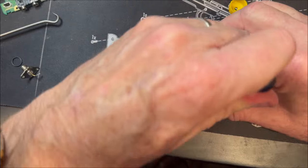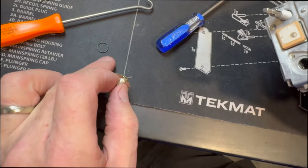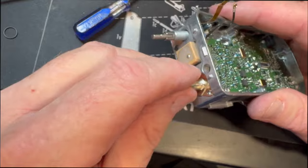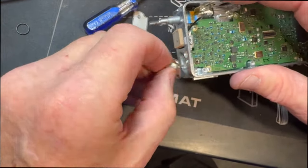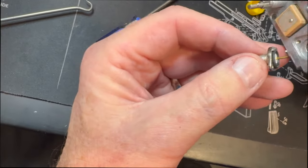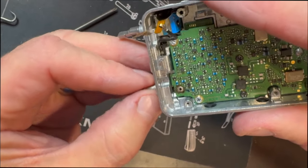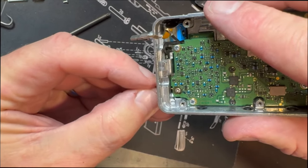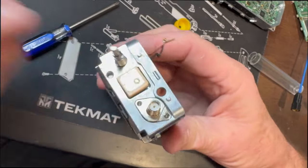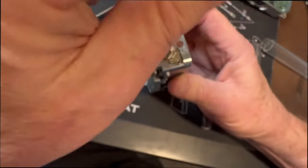The next thing is the antenna connection. I'm not forgetting the washer and grommet seal — I just want to position this first. This rotates, so I'm making sure it's at the right angle and seats correctly. Now put the rubber grommet on — be careful not to distort it, make sure your little locating tab is lined up, and be very careful not to lose your orientation. Once you've got it in there flush, get the two special screws and tighten those down. Never solder the connector on first — always torque it down with the board already snug on the chassis.